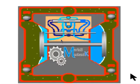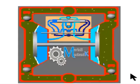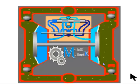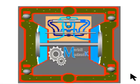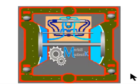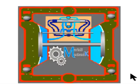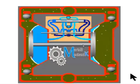One other thing is the diaphragm itself getting cracked or spoiled. Let's say the sludge temperature is as high as sometimes 100 degrees. The optimum temperature for sludge transfer is around 40 to 50. 70 is acceptable, but there might be a problem with this kind of pump, as some water in the sludge might evaporate and create a vapor lock. For that reason, we maintain 50 to 60 as an optimum temperature.